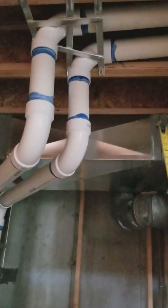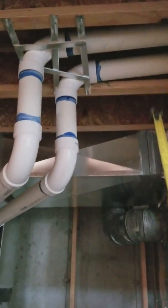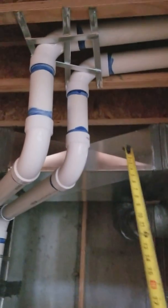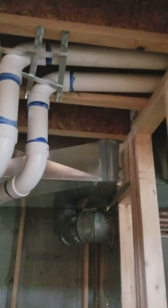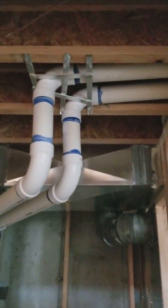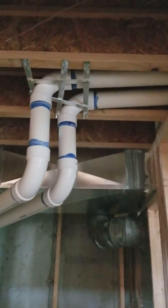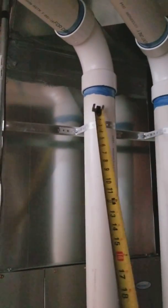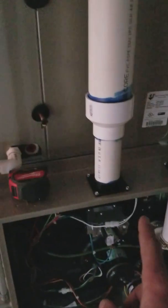Rule number four is to secure your pipes. This is especially important where they drop out of the joists. If you secure them front to back and side to side, then when the plumbers come through shoving pipes around, the electricians are yanking their wires, sticking can lights up in the joists, or the insulators are coming, you won't have issues with them yanking your pipes around. It's also nice a couple feet up from the furnace to strap your pipes — they'll be nice and sturdy. That's especially important on your intake, which is not very durable, but if they're strapped they will not go anywhere.